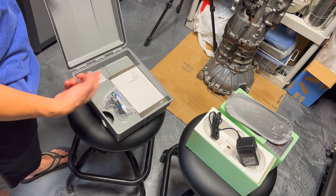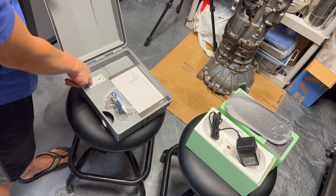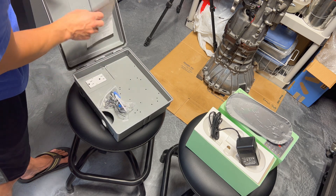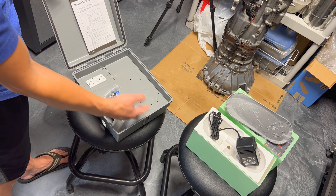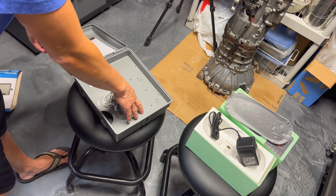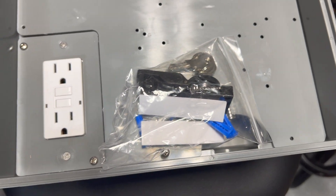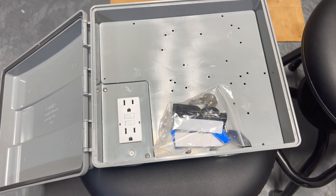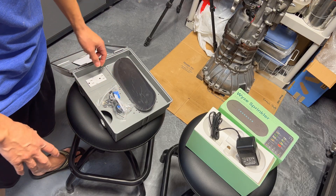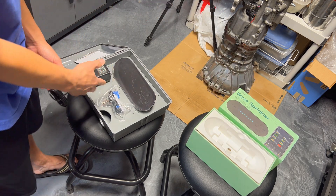Once we take out the Hunter one, I'll show you the transformer we're taking out — you just have two hot leads and need to wire them up to this plug. The box has a front plate and comes with a locking mechanism for tamper protection, all the screws, and a front plate that your controller mounts to. This thing lines up with one hole; you probably just have to drill a second hole. The only problem is the transformer is going to cover the second outlet slot.